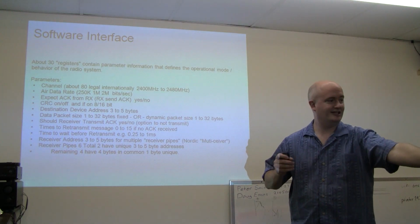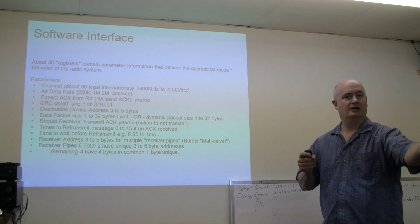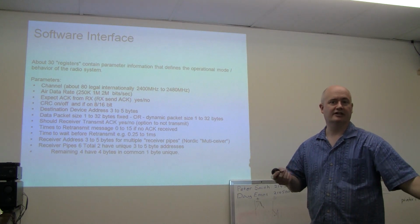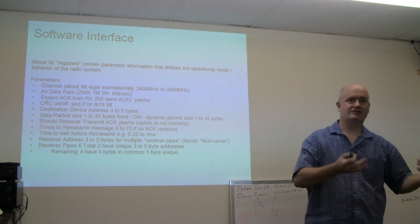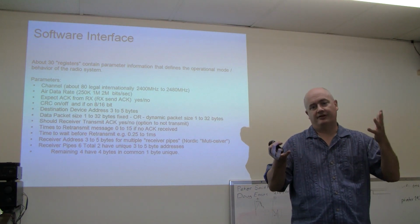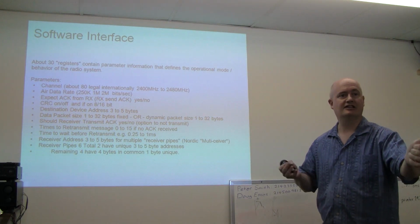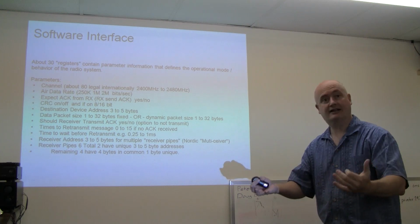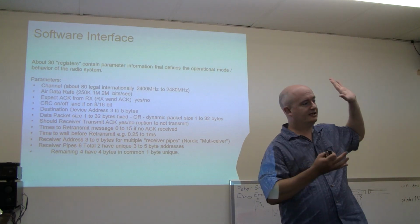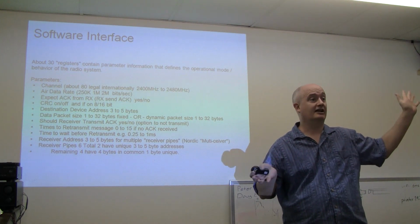And we'll say that Steve is the controller, Paul's the radio, I'm a radio, and Dick's a radio. So all the meanwhile, we're doing a lot of things between Paul and I that these guys don't have to be involved in, and that's kind of the whole point. All Dick has to do, once he has me set up with an address, he can just throw a number of bytes of data, and then I'll send it, and we'll sit here and work it out till we give up, oh, Paul is not listening to me, I've done my 5 retries that I've been programmed to do, then I'll set an interrupt flag over here to Dick to say max retries, and we didn't make it.